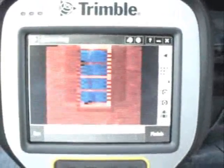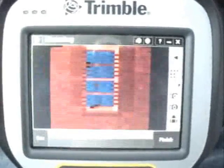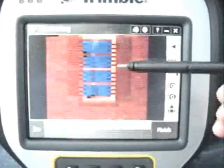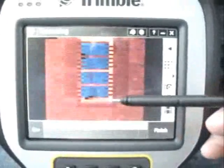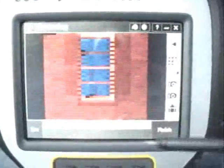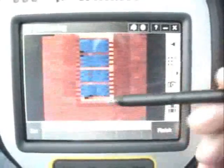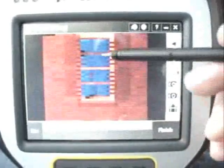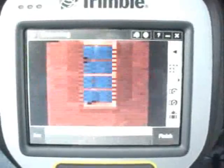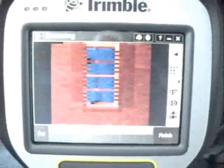We jumped back inside and the scan has completed. You can see the mesh on the screen and the area defined and outlined in white. The different colors indicate the different reflectivity of the materials — you have the stone wall, you can make out a little bit on the sides of the shutters, the white trim around the window, and then blue areas on the window panes looking through the glass itself, so you're getting a different return signal to the instrument.